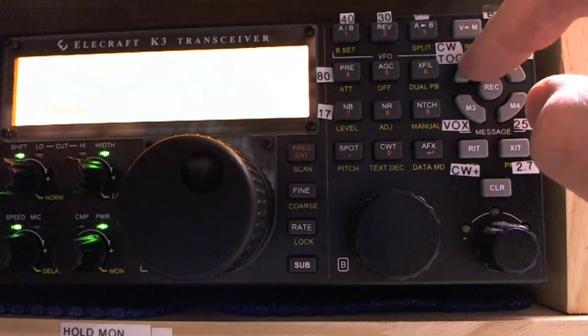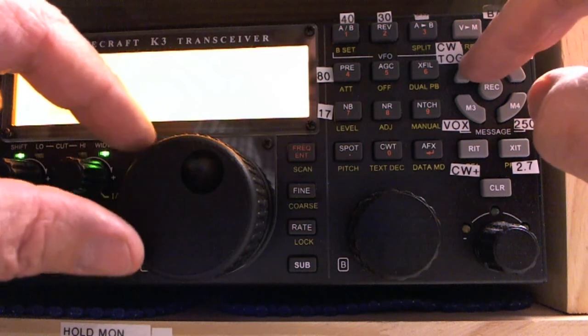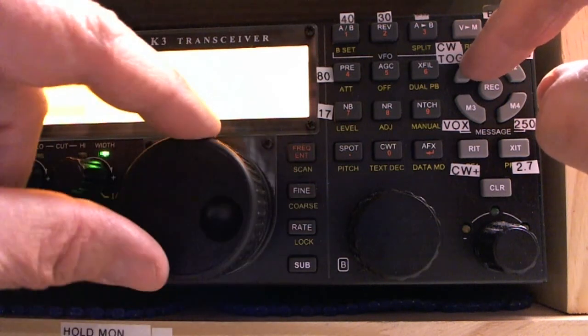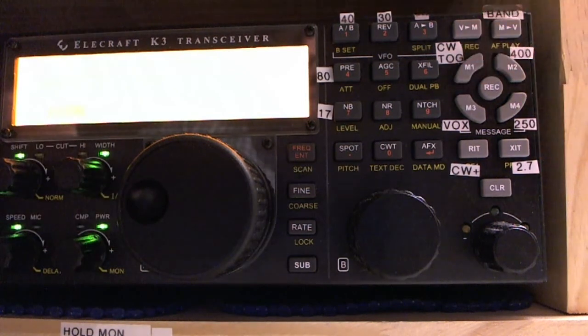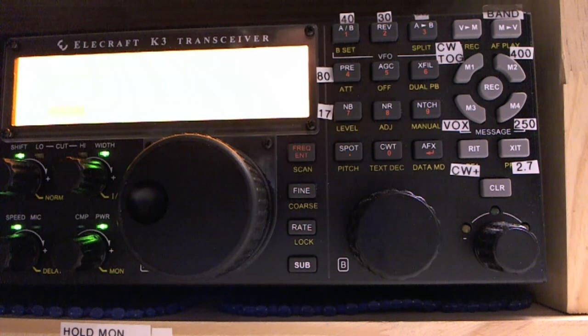You can hear the big difference there, so I'm going to go back and try to tune that in. I'm tuned in now and there's also a big difference in response since it was off the filter quite a bit. This is up at 40.202 — that's actually getting between three and four hundred Hz. Let me see: 40.202 minus 39.863 equals 337 Hz. I thought maybe my estimate of 400 Hz was off by as much as 200 — I thought maybe it was only 200 Hz off — but I'd say it was more like between 300 and 400.